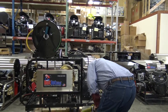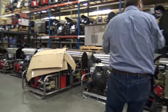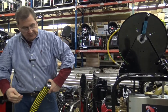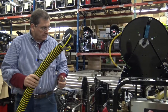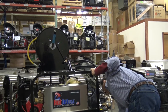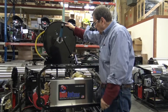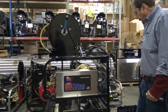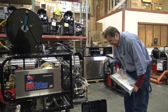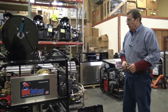That's a hose protector — you can feed your hose through it to protect your hose from getting scuffed up, if you've got a bend you're going around or down. There are a lot of steel manhole covers, so that's a good tool to use. Make sure it doesn't tip over on top of you. Don't turn this on unless it's in the pipe. Make sure your water's on before you operate. Check the pump oil and have your guys sign off. The safety sheets and manuals are inside there as well. We supply gloves and safety glasses with all our units. If you have any questions, just call our shop.